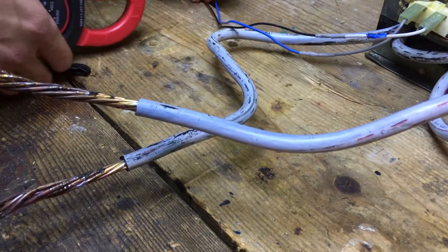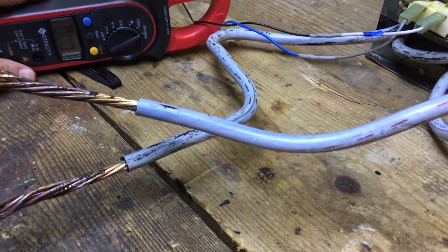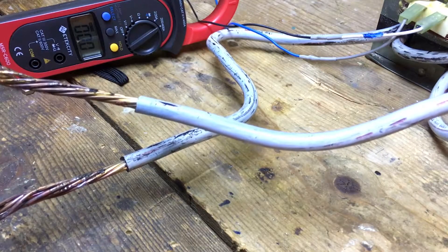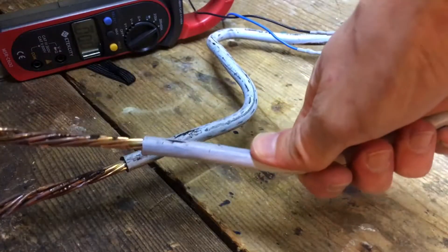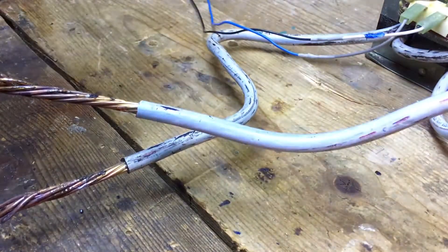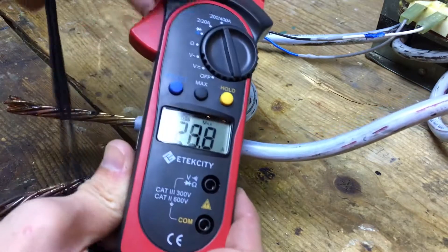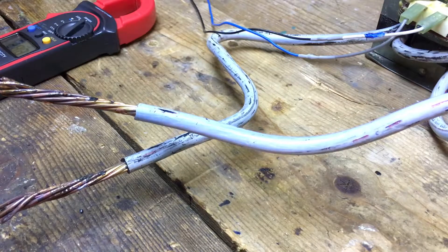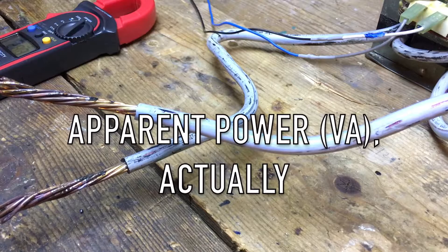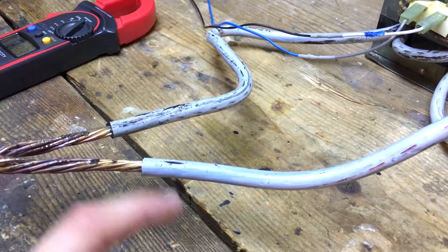I want to see what the input current is — that's going to be at 125 volts. I'll position the meter so it can be seen. I'm just going to short the leads and measure the input current. The maximum reading held was 28.8 amps input. If we round that off to 30 amps input, that means the total wattage is 3,600 watts — and this came from a microwave that was rated for 1,500 watts.